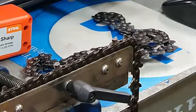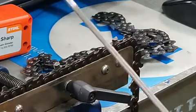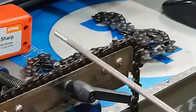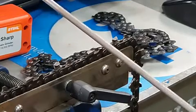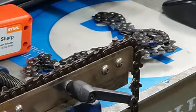Today we're going to look at the various methods you can use to sharpen a chainsaw chain. The most basic method, used for many years and still working well today, is the humble file. One thing to note: don't buy just one - buy them in a pack of three. I only buy Stihl files, about ten dollars for a pack of three, and I keep about half a dozen on hand. They don't last forever, so if you can't feel them taking metal off, throw them away and get a new one.